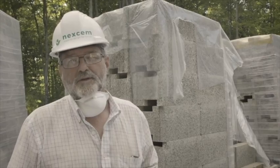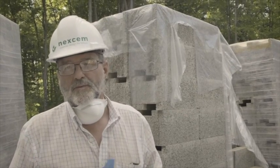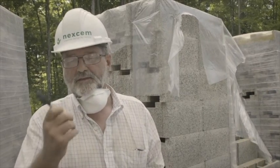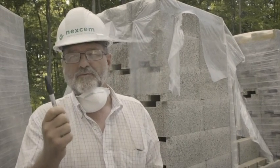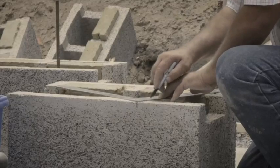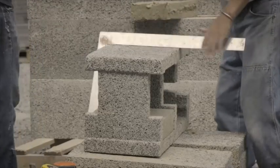When you're cutting a miter joint, there are a couple of things to keep in mind. You want to be as accurate as you can. A square is real handy — these are great — and a magic marker or some type of marker. Don't hold it straight up and down, it'll wear out in minutes. Just a light line and you'll be able to see that cut.